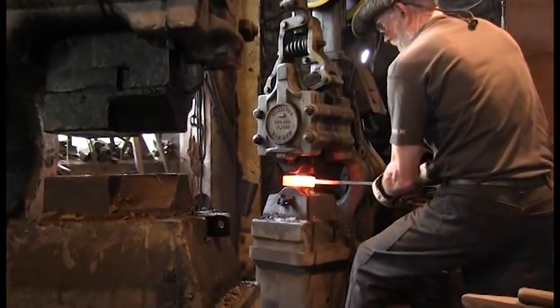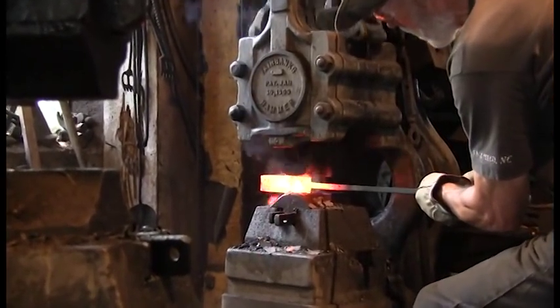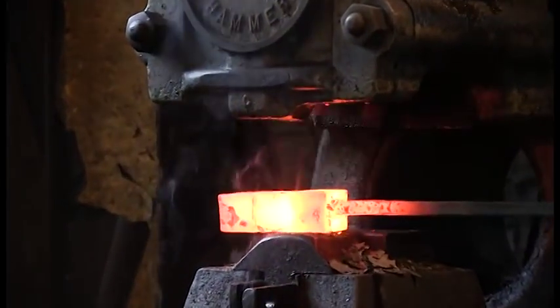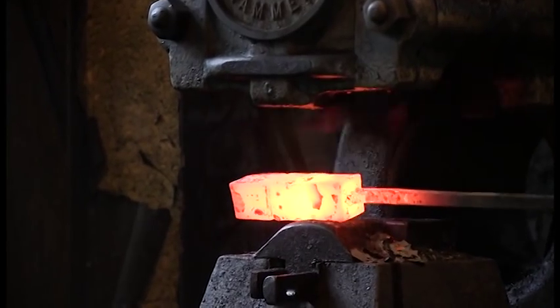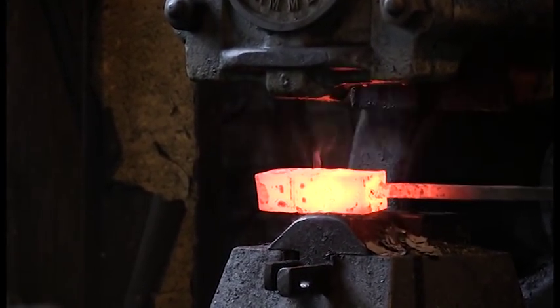Here we are, forging a personal hand hammer. Since this is not a production run, we are just coaxing it along almost in slow motion, crushing it in one plane and then flipping it 90 degrees to crush it back towards square, and then we're hitting it out of parallel to better establish the exact rectangular cross-section that we want.